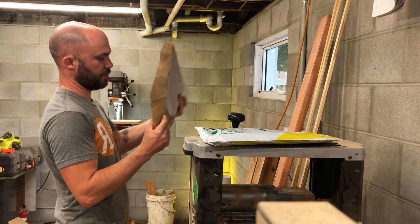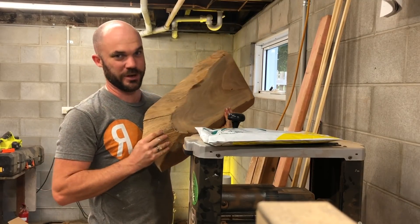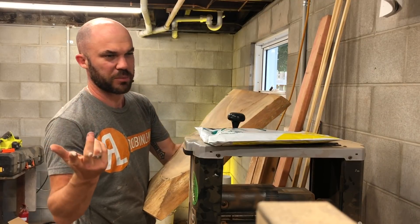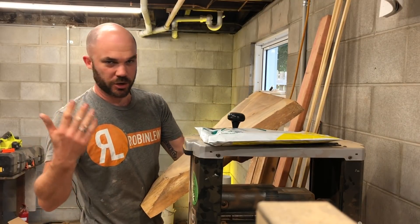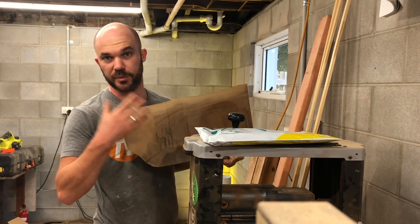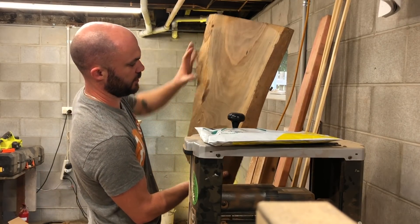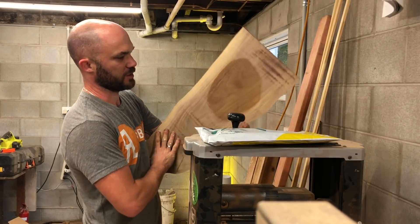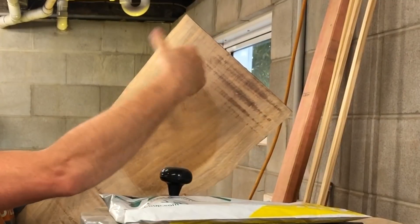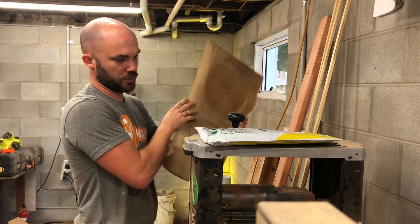This is a very nice piece of some kind of hardwood — I'm not sure what it is. It's extremely solid and mostly dry. I got this cut about eight months ago, and what I wanted to do before it was fully dried was remove some material so it dries quicker. I put one side through and it came up beautifully, but then on this side you can see all these black lines — that's the thicknesser bogging down and burning instead of cutting through. This is what prompted me to get some new knives.